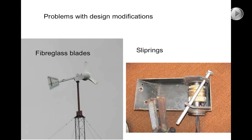The worst problem was that in the American market they identified a need for slip rings. I've never really been too keen on slip rings because they introduce extra cost and complexity into the turbine design — extra things to go wrong. I like wires dangling down the middle of the tower and simply untwisting them if necessary from time to time. But for the US market, it wasn't really possible to stop people worrying about these wires twisting inside the tower, and it turned out to be a marketing issue that needed to be addressed.